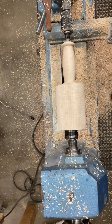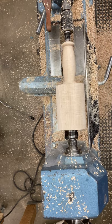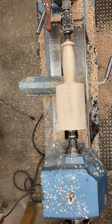Okay, now I'm not gonna measure it. I'm not gonna try to caliper this from a full diameter down to anything. I just know that I'm making a taper here, okay? The only layout that I do have to do, okay, is my little bit of back cut right here. So we do that little bit of back cut so that we don't get what's called short grain, okay? If I were to take this cut all the way to the top and have this just come straight across, I have little bits of grain that are sticking like that, okay? If I happen to hit that, this is just gonna break off, okay? But if I get rid of that now, I have much less risk of having this little bit of short grain on it.